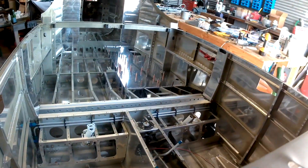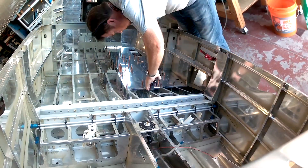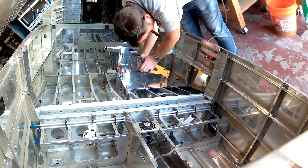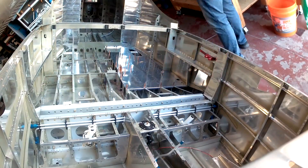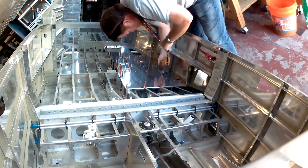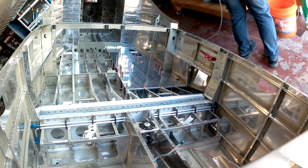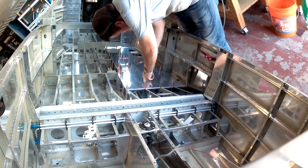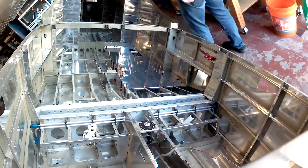Both of these are going to be attached via the master switch. These plugs won't just be available freely — they're not hooked to the battery, they're hooked to the master, so the master will have to be on for you to charge whatever you want. There won't be a lot of stuff that comes on with just the master — I believe the intercom system will come on with the master, and maybe one of the G5s. Everything's behind its own breakers, so that's no biggie.